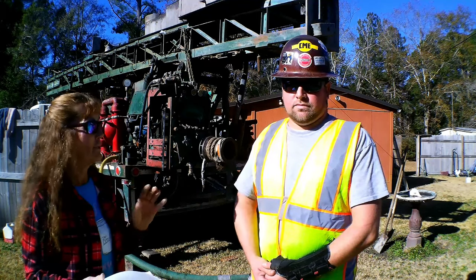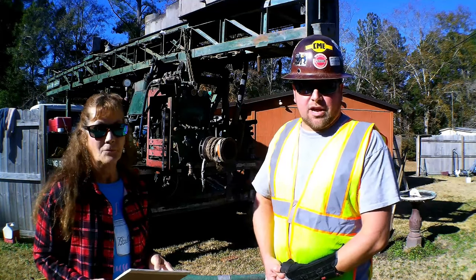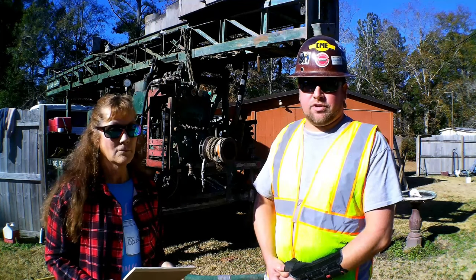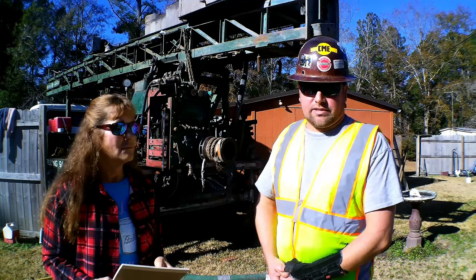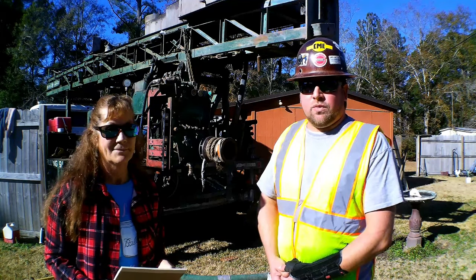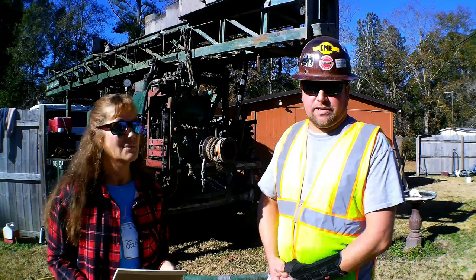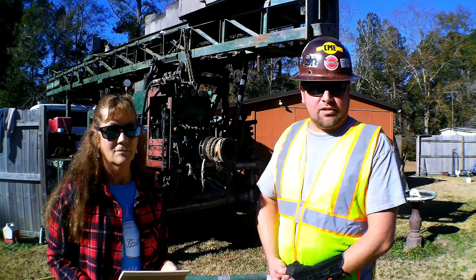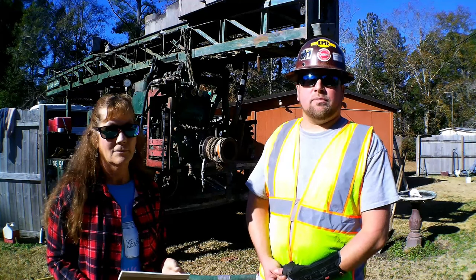So one last question, how long does it take to set this up through to completion? Well, yesterday we mobilized equipment on site, so everything from fueling up, checking your oils and fluids on all your equipment, getting to site, that's one thing. Now we're going to start the setup process with a crew of guys that have been around and have done it in the past. It should take about an hour to get everything ready to drill, from air compressors, airlines, pumps, service truck. We have water on site. So there's a lot of moving pieces.